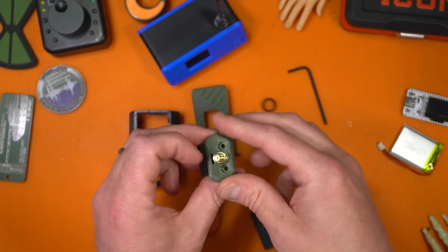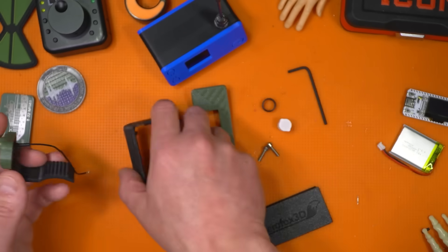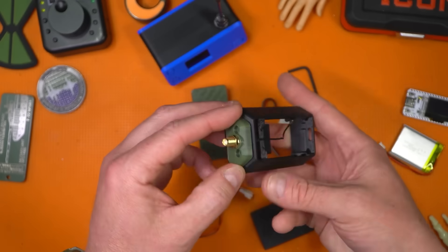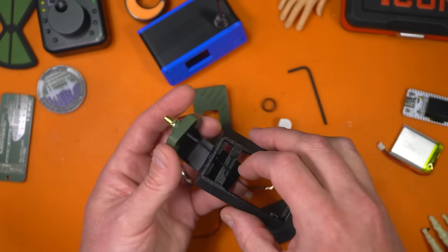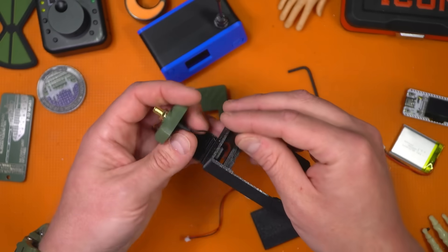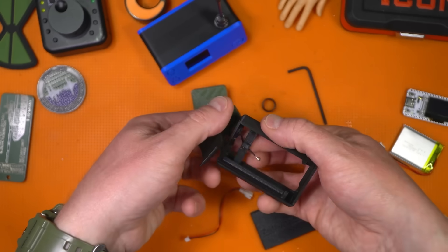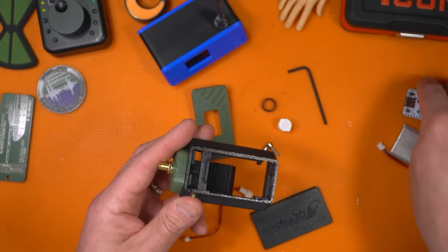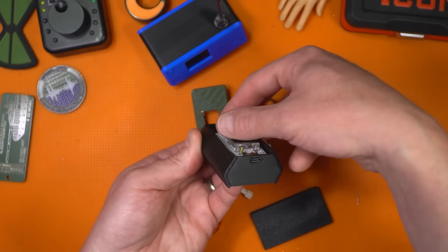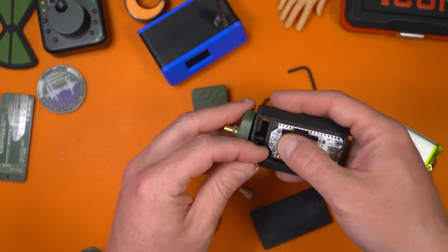It's tight enough — we don't need to go any deeper than that. Feed the antenna through the hole in the back, and fold it under the antenna underneath the back where the battery is going to go. The battery goes down here. Then take your Heltec, line it up with the charge port first, and it just kind of lays in place and clicks in.